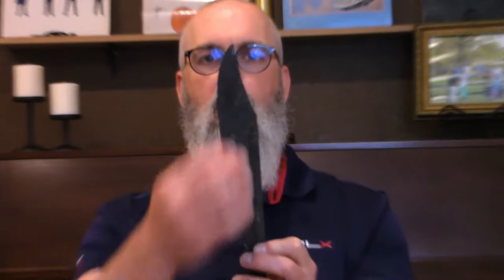Overall the shape's great, but a couple of errors that I made on this one were basically I tried to get rid of the rasp feel on top of it, so I ended up making a super thin blade, and because I made it so thin, I just couldn't get the quench to not have a warp in it. So this blade's got some nasty warps in it, you can't see it here, that I tried to correct. Quenched it twice to try and correct it, but I just feel like I've either got, well, it's two things.